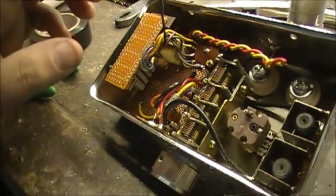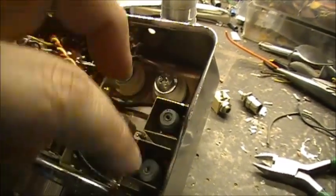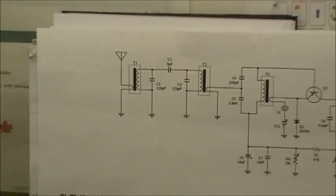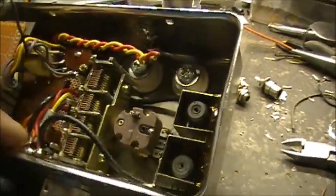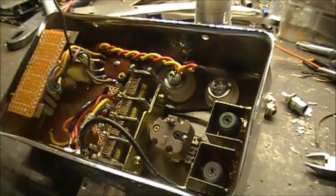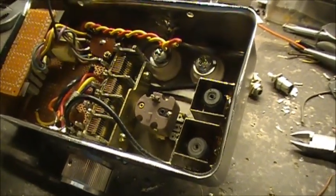And yeah. So again, that's the antenna positive. That's the ground. That's the antenna input circuit, tank, whatever. Basically, it's this part here. I got T3, which is hiding down here underneath all of this. Here's, of course, the crystal bank, tuning capacitor right here, and that's gonna be my on-off power switch, and sensitivity control will be on this control here. So there we have it.